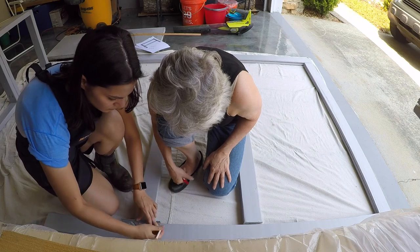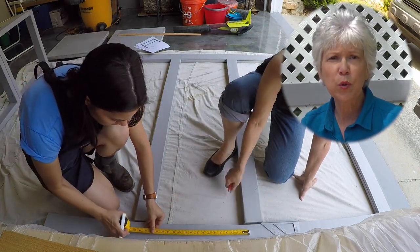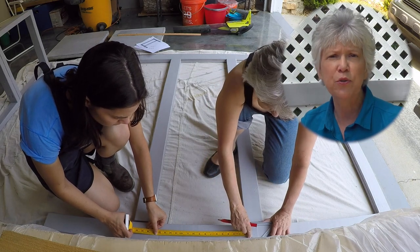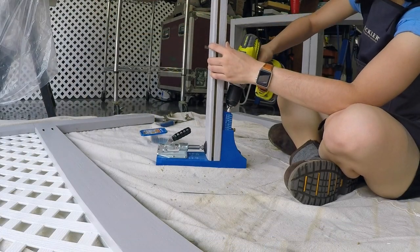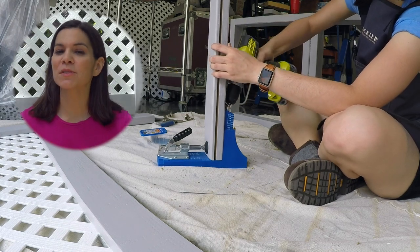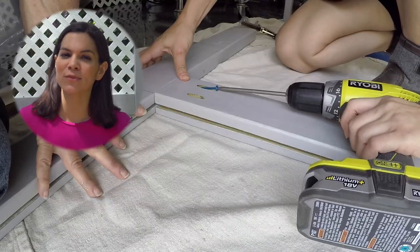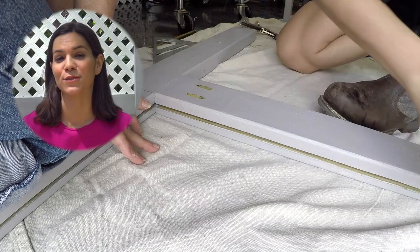Next, we assembled the back of the frame. One of the tools we really like is a speed square — it's a very simple tool, but it's great for making accurate lines, and you can slip it underneath a tape measure to really get an accurate measurement. One of the must-have tools for this project was the Kreg jig. It helps us make pocket holes, which allows us to join wood together. We've tried doing this without pocket holes and it was a challenge, so pocket holes were definitely the way to go.